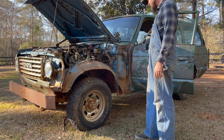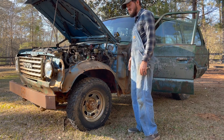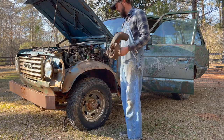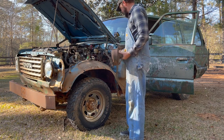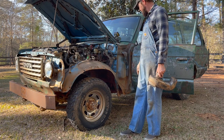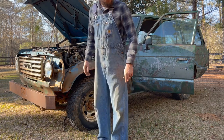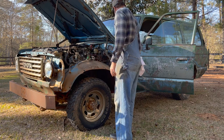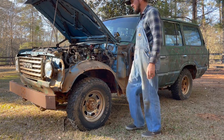This looks beautiful - no rot, no rust in here. The fact that I only broke off three bolts, not too bad. As you saw, we had to pull the blower motor - it was bolted to the inner fender with four 10mm bolts - then you had all of these right here, all those in there, all those up there, all these in here. A lot of bolts - never seen that many bolts on a fender before. Maybe that's why people do what they do to Toyotas and they just kind of stay together. With the door, pretty straightforward - looks like only four bolts, there should be no surprises there.